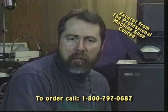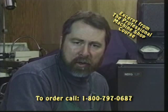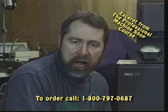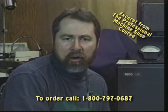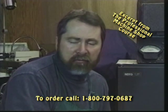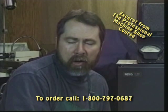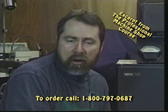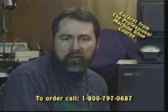I hope I've provided you with a basic understanding of heat treatment. Let's go back and review a few things. We need to know the type of alloy we're heat treating, its critical temperature, the temperature at which we will temper the part to bring it to the desired Rockwell testing. If you're unfamiliar with heat treating practices, by all means take the commercial heat treater to lunch sometime, bend his ear a little bit - you'll find him more than helpful in bringing you up to speed with your own little heat treat oven. They're an invaluable source for information. They do this for a living, so they're familiar with all of the different types of alloys and what works best in order to achieve your desired results. There are a lot of good books available. Some college courses offer a course in metallurgy - that would be a great thing to take in the evening to expand your awareness of tool steels, alloys, and heat treating properties.